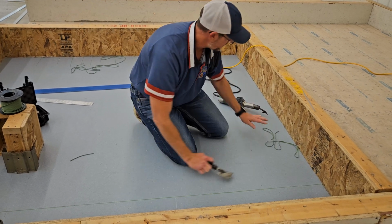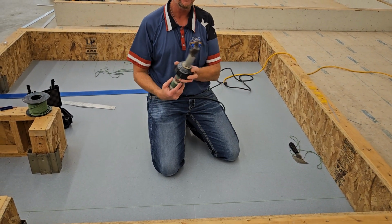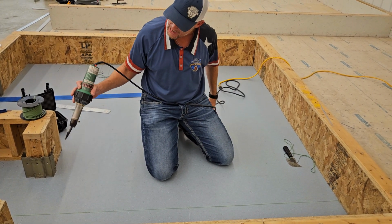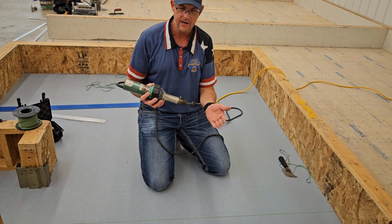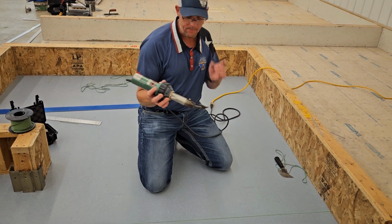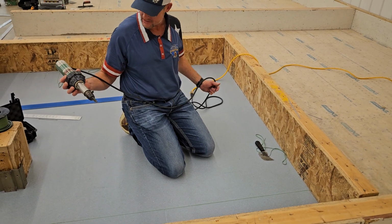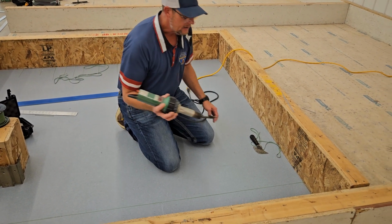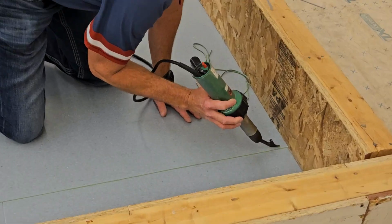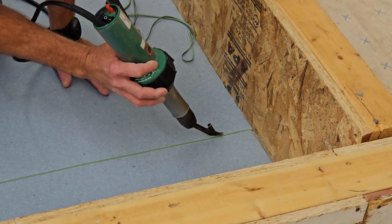that is welded. Now, you can also take your welding gun and slowly run it over the top of the seam with your heat. It's called glazing the seam. And what it does is closes the pores in the weld. So I will slowly give this seam a little heat all the way down.